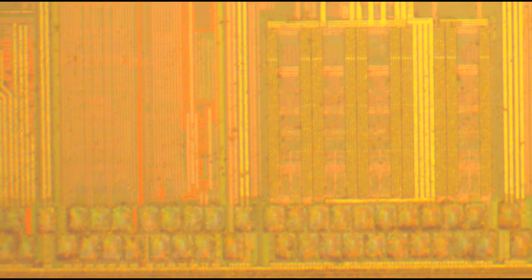Not sure which way this one went. If I zoom out a little bit you can see classic things like the bond pads, where the actual die gets connected back into that ball grid array — BGA — package, so it can then be soldered onto the circuit board. The peripherals are always on the edge; these are things like the HDMI and the USB. Going further in you can see a large metallization area — this is basically the random logic. Buried under there will be the ARM processor plus all the random logic required to glue the chip together.